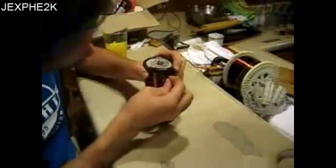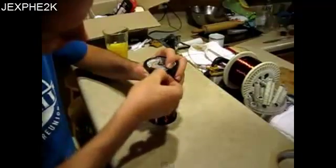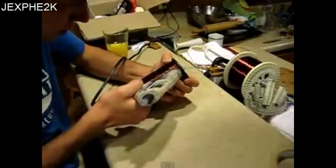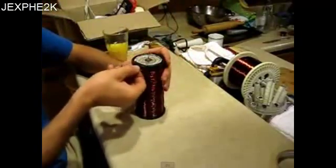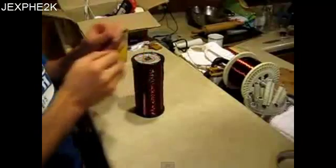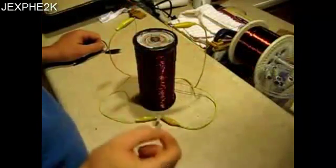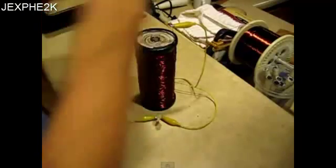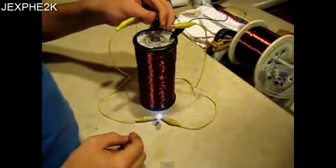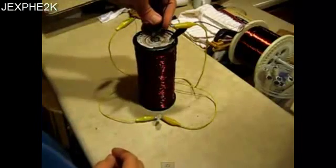Now that we've got this secondary wrapped on here, we will feed the other end of the secondary wire up through the hole that we had prepared earlier. To keep it from unraveling, I'm going to put a little bit of hot glue on it right here where it goes in, and then pull it tight. Now I'm just going to strip the enamel off these ends and we'll test this. I've connected two wires to the terminals of the secondary. You'll have to play with the LED to find the correct polarity. So I'm going to short my outer iron wire to my inner copper wire. When I do a make-and-break switching on this wire, we do get light on the LED. We have success.